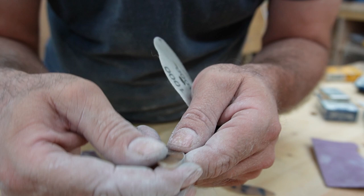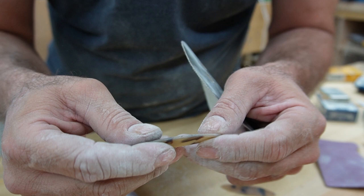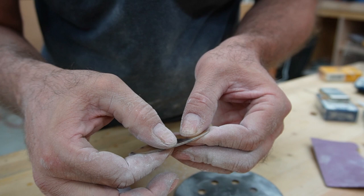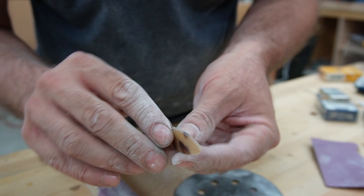And I'm just going to keep going with a little finer grit, try to get some of the larger scratches out from the 400 grit, and then I'll switch over to probably some 2000 grit and do a little bit of polishing on them, see if we can't get a decent shine. Not too worried about the faces there. I might even put some checking on there just for some grip, but you really want the sides to be nice and shiny, because that's going to give you a really clean sound, no kind of raspiness. All right, see how they turn out.